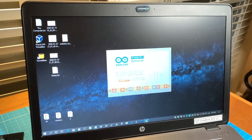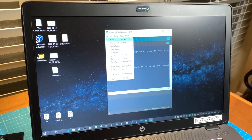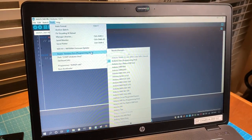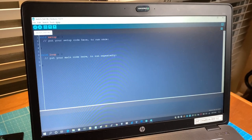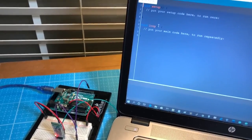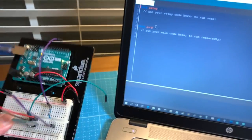Are you ready to write the easiest Arduino program you have ever written? Start your Arduino software, do File > New, make sure you've got the right Arduino board — in our case the Arduino Uno — and select the correct COM port. With a new fresh file you'll see it just has the two traditional sections, Setup and Loop, both blank. I've disconnected pins 1 and 0 on the Arduino to allow the program to be uploaded across USB. Let's hit Upload.